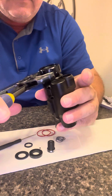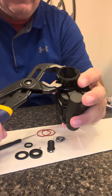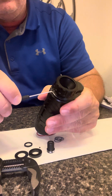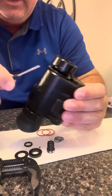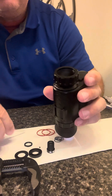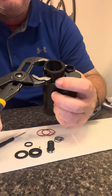Put the jaws flat against the surface and clamp down. Make sure you're not touching the lens itself — if you use too much, you're on the lens and not the module. Come back and you'll be on the module and not the lens. Make sure you're spinning the module itself and not the lens. You can also make a hash mark on your module — a little scratch — so you can tell if you're moving the module or just the lens. There are no markings on this module, so the hash mark really helps.